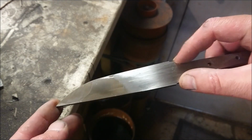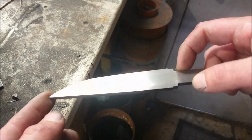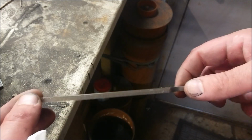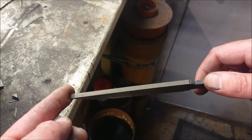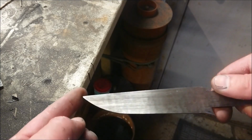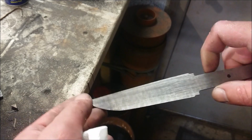We've got shoulders milled in now. That radius relief, like I said, these will bang on, and I've just finished up cleaning up the machine marks to 600 grit on here and cleaning up the tang, putting a little bit of a chamfer on it. What I want to do now is dip this because I want to make sure that the core is central to the outer layers, and then we're going to crack on with the bolster and the handguard. But first, let's hit that camera one more time and give it a dip.